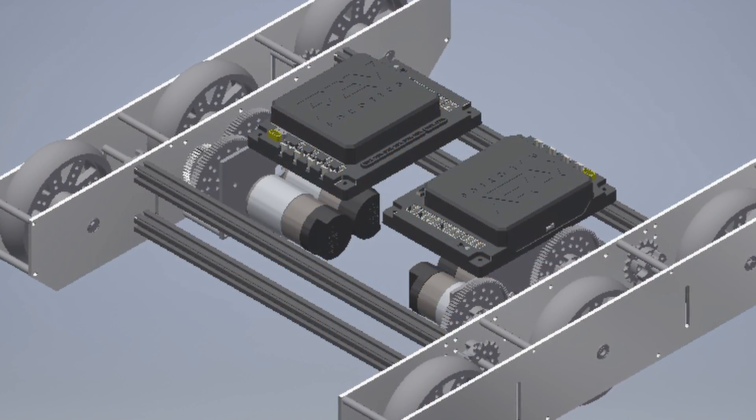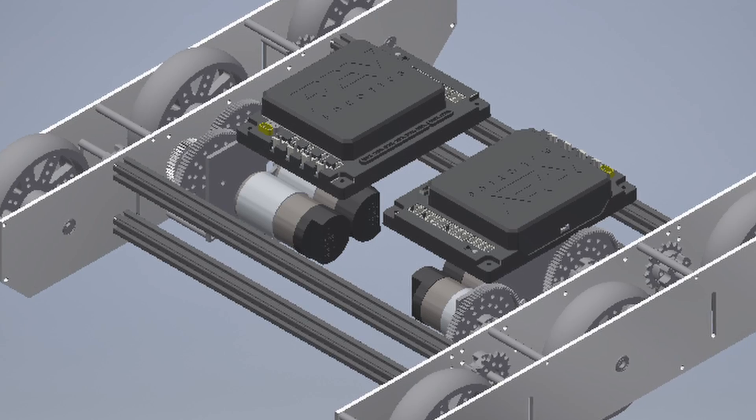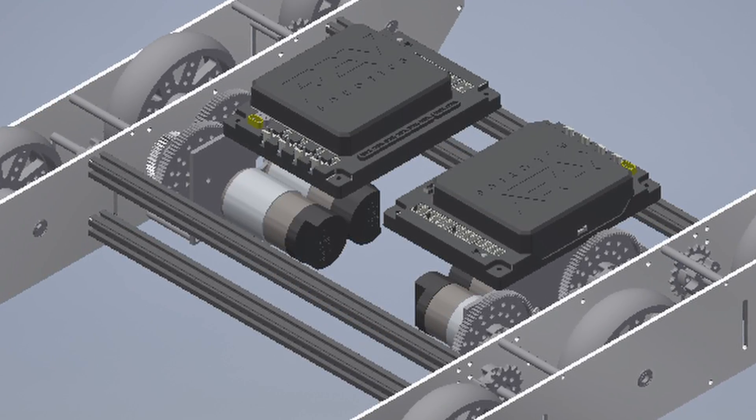While creating your robot, use math and physics to vet it first. This will help catch any design flaws before spending more time than necessary. When building, start off with a drivetrain and then add other subsystems to score points. Make sure to calculate the physics for each motion component. When calculating torque, double the requirement so that you're sure your robot will consistently perform the intended task.